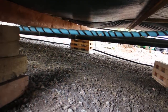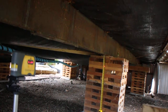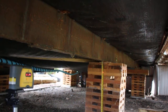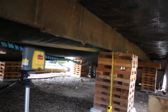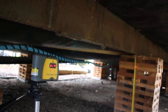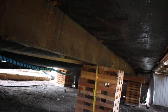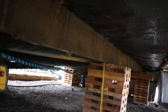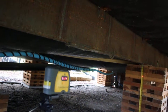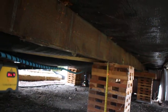Basically what you do is you find the highest point — in this case it was down there where you see the tape measure — and the most efficient way is to bring everything up to that point. We have a laser set up here, and you can see down there there's a laser line on that tape measure sitting right at five inches. We go around the entire building from crib to crib, all fourteen, and bring them up so the laser hits that five-inch mark on the tape measure all the way around — then we know we're level.